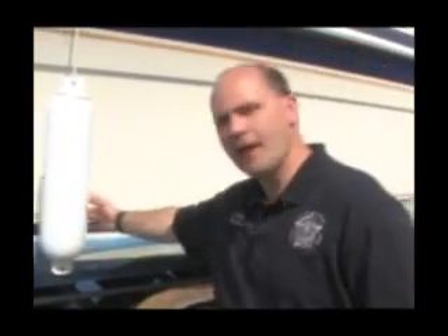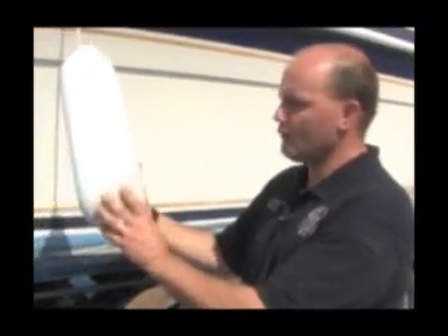Through-hull fittings provide all these things and make lots of areas for mussel attachment. In addition to inspecting all the various parts of the watercraft — from the hull to the out drives, transducers to the bilges — make sure you do not overlook things such as fenders. These hang in water and mussels will attach to them. Also, make sure you inspect the anchor, the anchor line, and anything that contains water — even hatches that have life preservers in them.